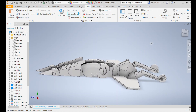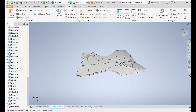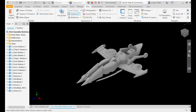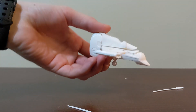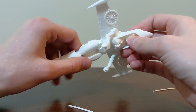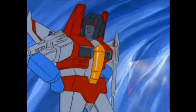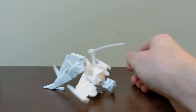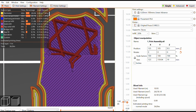After figuring out the legs, I moved on to the torso, starting with the base to set scale and then working on the complex curves in both the torso region and the cockpit portion. A somewhat late addition was the landing gear for jet mode — I was particularly concerned with the compliant mechanism that locks it in opened and closed positions. As a final touch, katanas that store as wingtip blasters in jet mode. A quick check in the slicer and it was ready for printing. The first prototype was good: hips, knees, shoulders, cockpit, and even the landing gear worked, though it was a bit short. But the ankle locks didn't work and it couldn't stand, so I remodeled the arms, adjusted joint tolerances and sword fit, and sent it back to the printer.